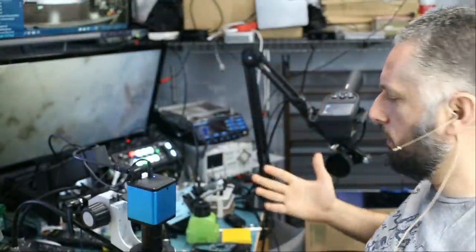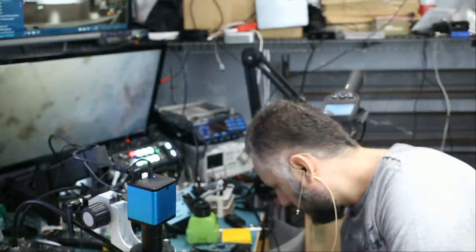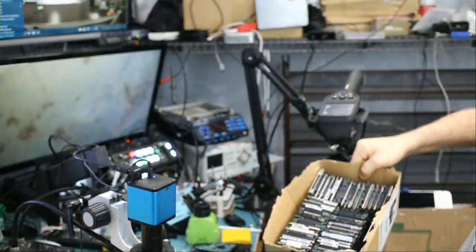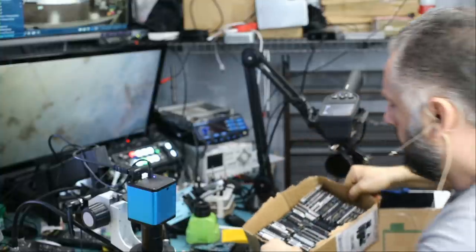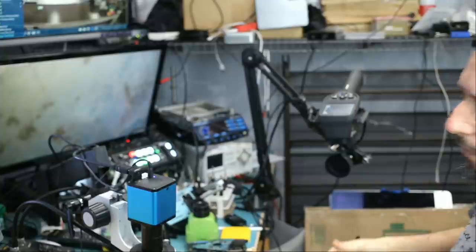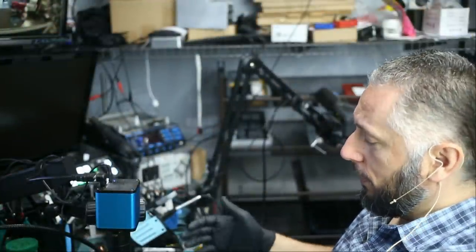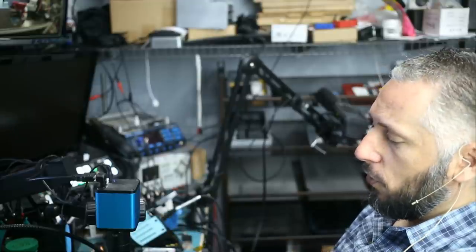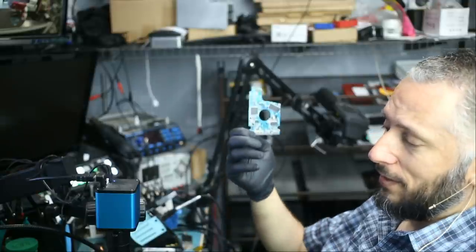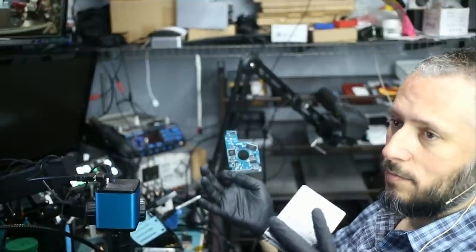The good thing is over the years we accumulated over 700-800 different types of hard drives. So I have about 20 of those boxes that contain damaged drives. What I do with these is I use the circuit boards to data recover other hard drives. I had to leave this video for another day. The reason is I had to look over all the salvaged hard drives, and great news, I was able to find exactly the same board. This is the exact same board as the customer's drive.